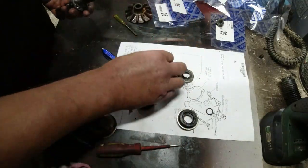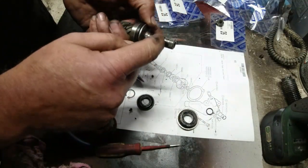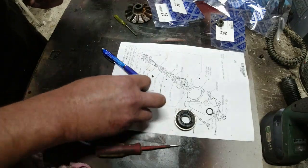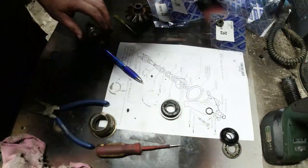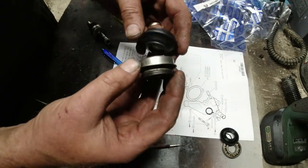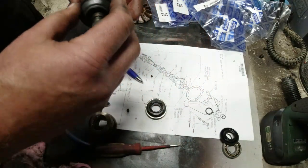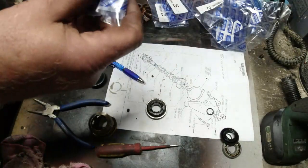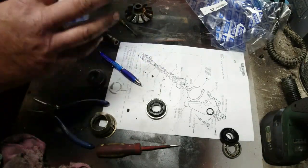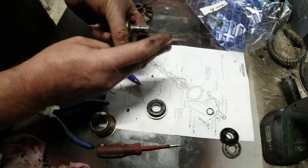The circlip's in place. Next, the brand new oil seal goes on followed by its little top hat. I've pulled the o-ring off the end of the shaft because that needs to be replaced. Then we've got the water seal next — that's what the water seal should look like. That goes on that way up, and then we've got the o-ring at the top. Small o-ring, big o-ring — checking part numbers: 1467-60.